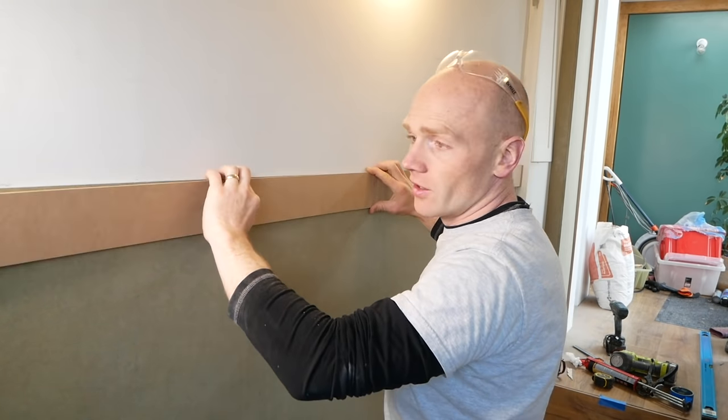And what you saw me do is start off with an MDF sealer. That's only really because the cut edges on here, we're not putting a trim. On the other room, we've used 12mm, and every single one has a slightly profiled moulding in there, just to give it a bit more of a raised panel look. Because we're leaving this edge exposed, cut MDF is not ideal for painting. So by putting the sealer on and then giving it a sand, it stayed nice and smooth.